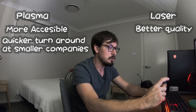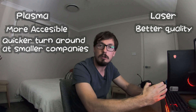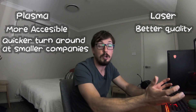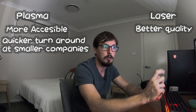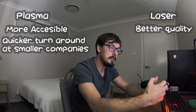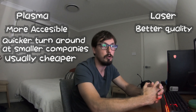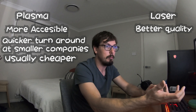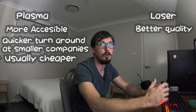If you just want two little brackets cut, a long laser cutter lead time might not be worth it. If you need something super accurate with tight tolerances, go for laser cutting — it's definitely more accurate. For a simple rectangle or basic hole, plasma cutting is plenty good enough; you might just need to clean the hole up a little. Laser cutting costs more because the machine is more expensive to run. Those guys also tend to fill sheets efficiently, so you may wait until they batch jobs together.